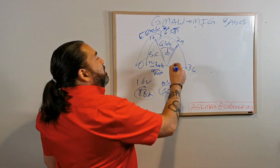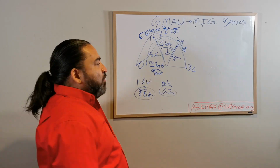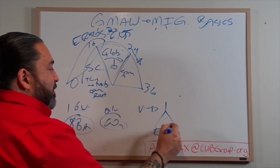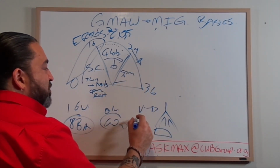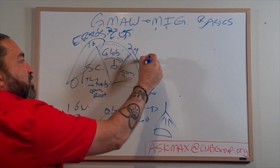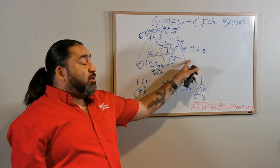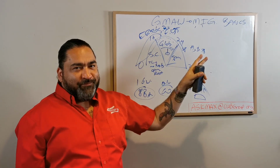That's no good. Then you get to spray over here, which is over 24 volts. Now we're talking. We're cooking now. We got lots of voltage to burn, make bigger gaps. We can weld further away, right? And we can accommodate bigger wires because we're going to be running into 200 plus amps. So this is heavy duty. This is expensive. This is industrial, okay? If you want to get into heavy-duty industrial welding or certified welding, you got to go here. If you're looking for at home, stay here. Anything in the middle, don't worry about it, all right?